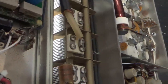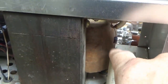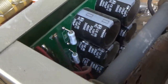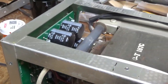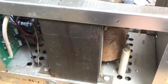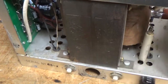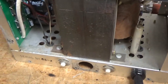It already has a Harbach board. Let me show you — here is the resistor. I have some of these so I'll just put that in. It has the Harbach filter cap board someone else put in. I'm going to replace these high voltage leads — this one's not good — and the two resistors like I said, and the resistor below. Also add reverse-connected diodes on the B negative below the supply cabinet and in the RF deck, so if there's ever a B positive short it'll protect the wattmeter.